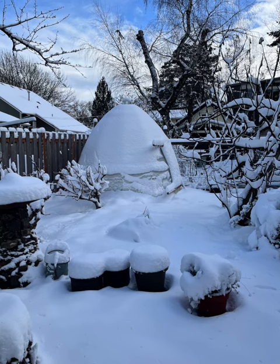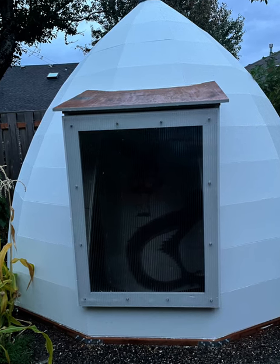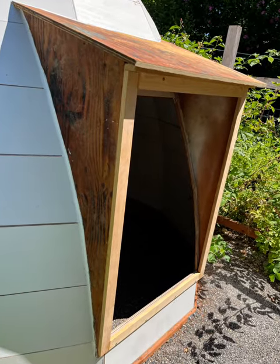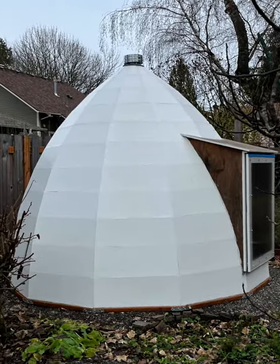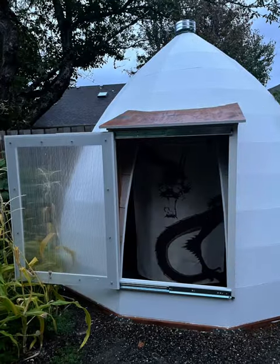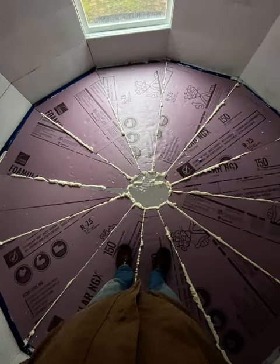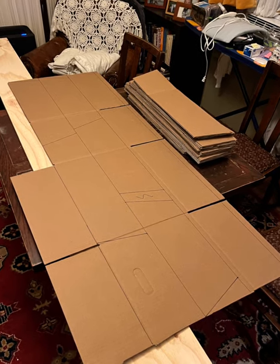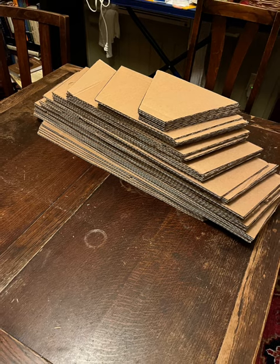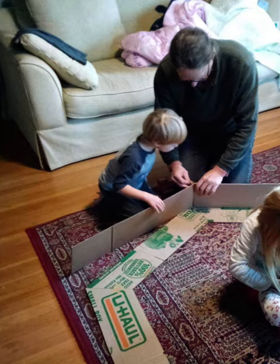The shell is primed and painted. The seams are now sealed on the face with Through the Roof, a copolymer rubber elastomeric sealant. The entry is milled from a dunnage piece of CDX plywood, and the door is a simple frame with dual-walled polycarbonate on 32-inch drawer glides. The floor is one-and-a-half inch rigid insulation and will soon be covered with a three-quarter inch subfloor. Once a few essential variables have been determined, a dome can be made from most materials or thicknesses and can be child's play to construct — to transform your world.